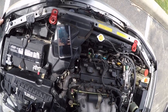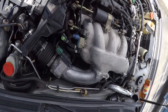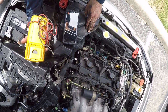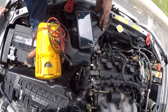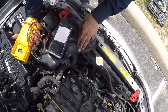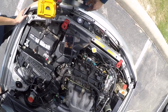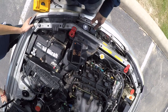So the idea is that coil probably isn't bad even though it had a different electrical reading. It's either giving off a spark intermittently or it's fine completely and something else is causing the problem. I'm going to suggest trying to swap that coil out and see if another coil acts better, because on the computer I didn't see anything pointing to one specific cylinder — it gave a multiple misfire code.